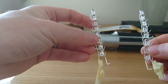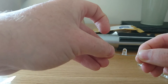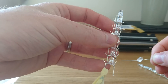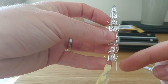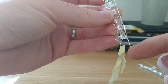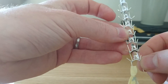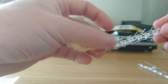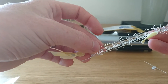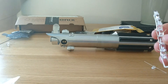As you can see, I'm starting to bend them to get them ready for what's referred to as the buddy method. You can see they're bent with a kink put in the leg — they are then slotted onto one another, bent up, and have a light bit of soldering. I've still got a long way to go to solder up the remaining 80 LEDs, but I'm on my way — so stay tuned for more updates.